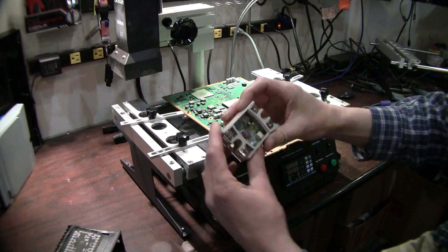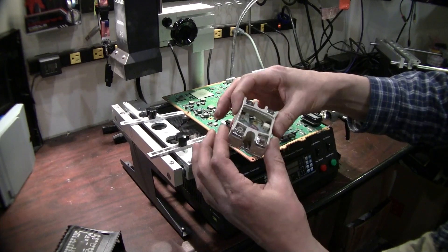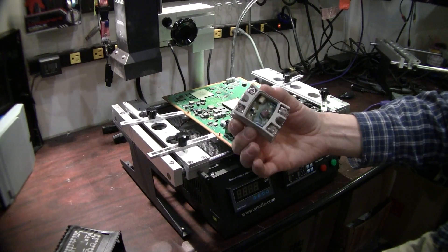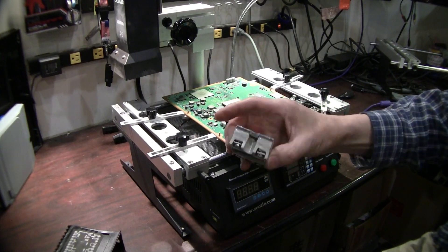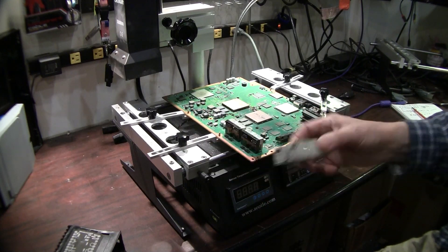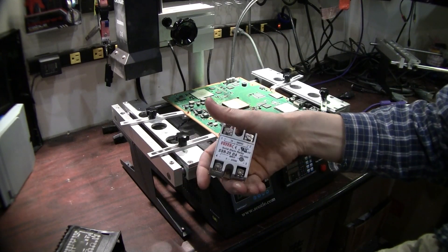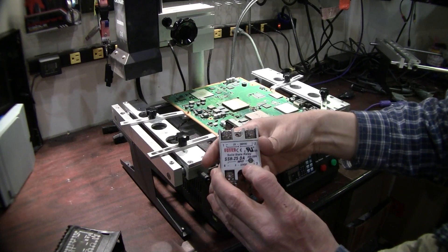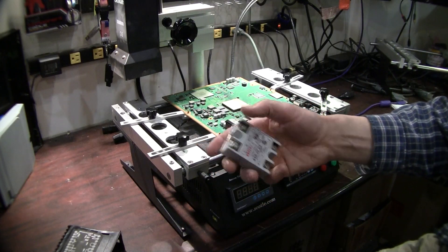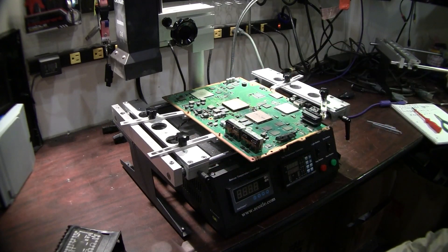The front panel fell off, and you can see they are no longer square — they are all rippled. The entire solid state relay heated up to the point where it started to melt itself. Ironically, I believe these solid state relays are still working okay; even though they started to melt, they still functioned. But we pulled them out anyway and replaced them. The replacement was a 25 amp, 3 to 32 volt DC trigger input with an output of 24 to 380 volts AC — this is the power side and this is the trigger side — and that replaced the units fine.